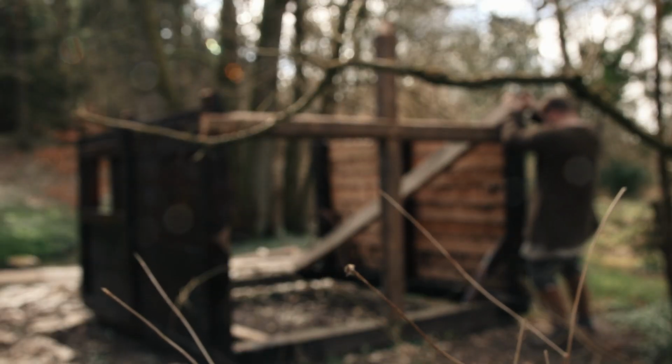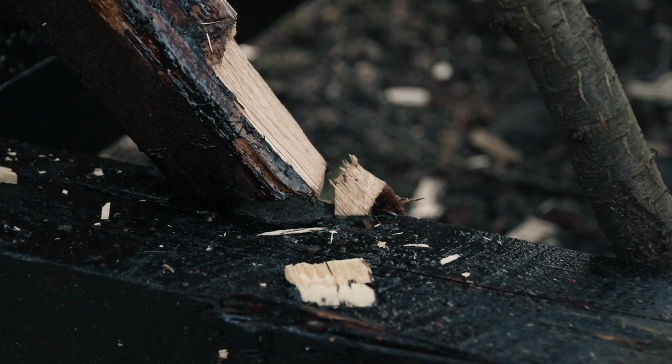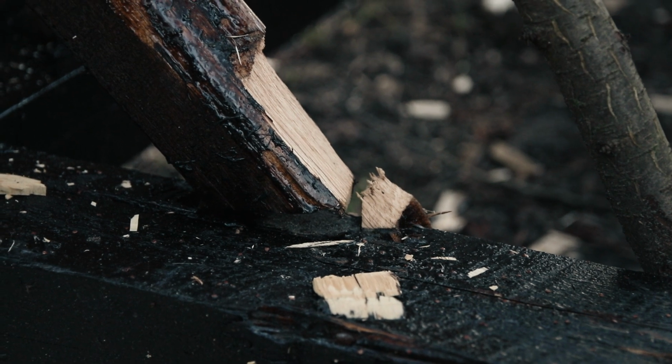So with the two posts mounted on top of each of the lower walls, it was time to have the center beam, the one that is a bit higher, installed. And I needed to install the two horizontal center posts, simple mortise and tenon jobs, and then mount the top beam. It was a little bit difficult to get it up there and balance everything out, and at some point I ended up dropping one of the beams, and it accidentally hit one of the knee braces and broke the knee brace in half. So yeah, quite a bit of a blooper. I'll have to address that at some point.